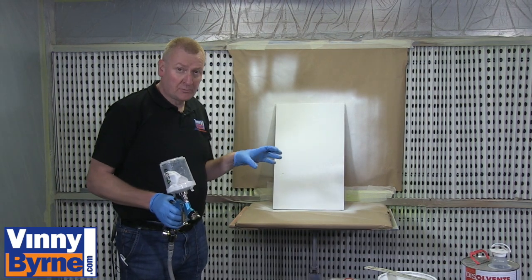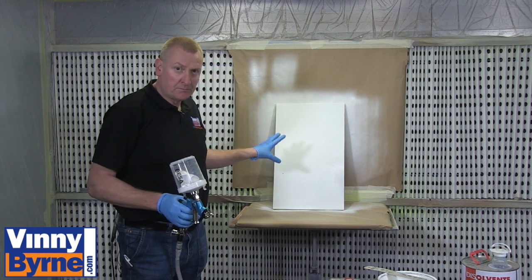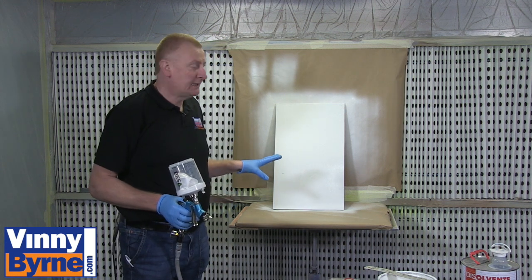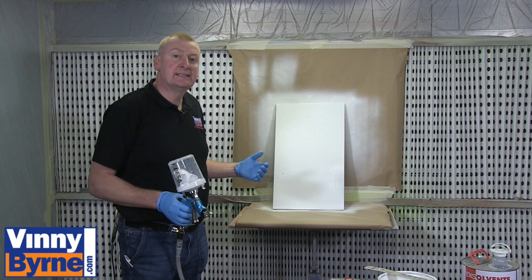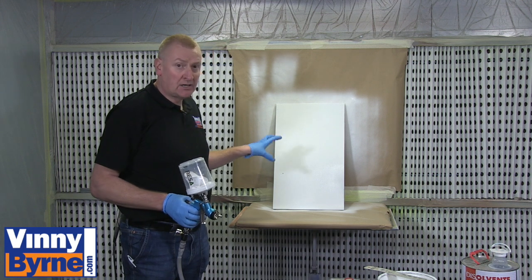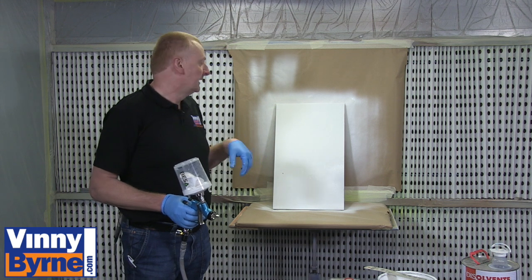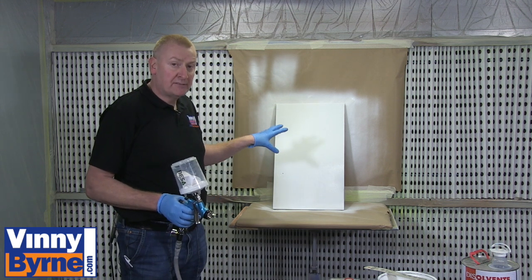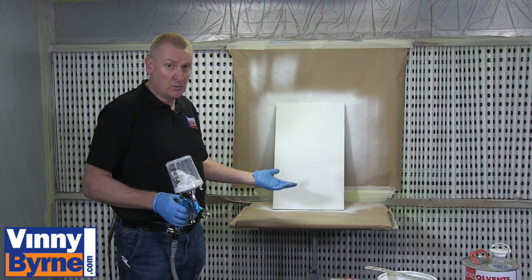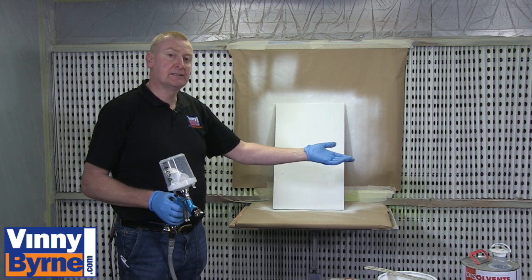We've applied our first coat of primer. There are two approaches. One: put one full coat on, let it dry for about four or five hours, then come along and sand it down with P240 grit. Have a look and see if it needs another coat — if it does, repeat the process. In this case it's a hardwood, so the fibers won't pop up as much as softwood. I'll give it about 10–15 minutes to flash off so the solvents evaporate, then apply another full coat, leave it for four hours, sand it, and then move straight on to the painting process.